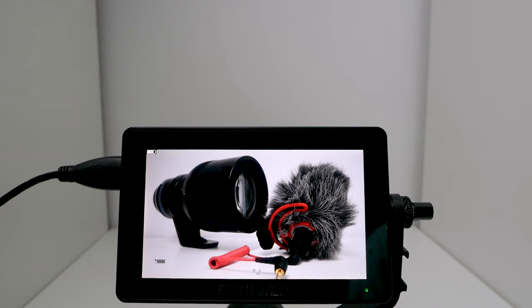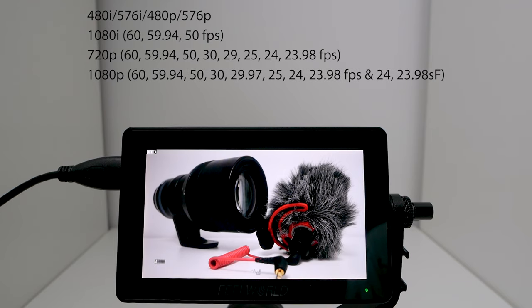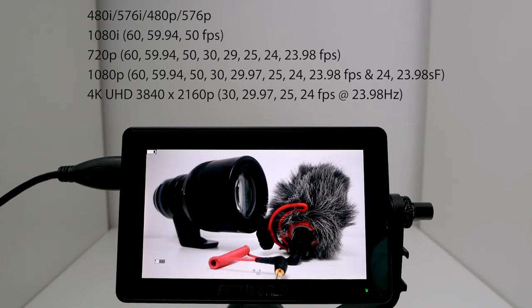The HDMI input and output formats supported are 480i, 576i, 480p, 576p, 1080i in 60, 59.94 and 50 frames per second, 720p in 60, 59.94, 50, 30, 29, 25, 24 and 23.98 FPS, 1080p in 60, 59.94, 50, 30, 29.97, 25, 24, 23.98 frames per second, and 24 PsF with 23.98 PsF. 4K UHD at 3840 by 2160p at 30, 29.97, 25, and 24 frames per second at 23.98